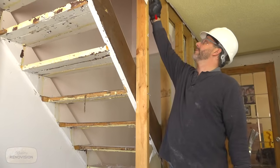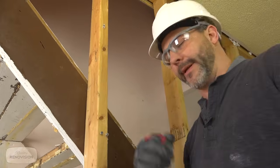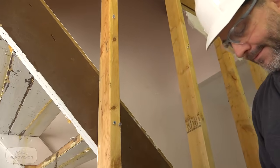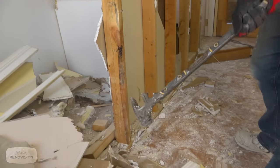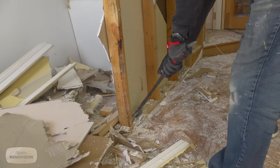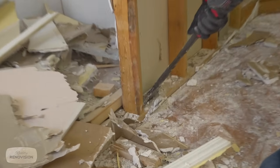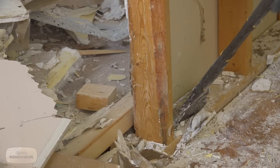This is made where there's two nails from the top plate and two nails from the bottom plate, and then they stand the wall in place. So the way to remove a stud, quick and simple, is actually take one of these bad boys from Stanley. This is my favorite wrecking bar. And this just batter up, right? Hit right down near the bottom. You don't have to be crazy with your force, just enough that you're going to be bending over the nails and knock the bottom loose.